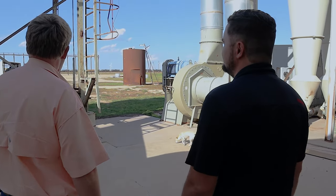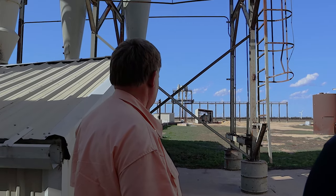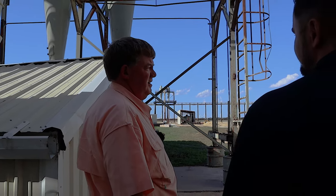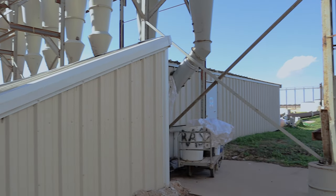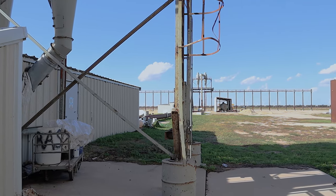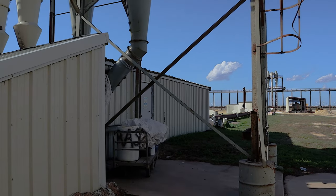What's with the new tank there? Fire suppression. Okay, so hopefully. Hopefully. And that's just for the burrs? Yes. Well, yes and no. It's a 10,000 gallon storage tank. We're going to be tying into it with some sprinklers and this, that, and the other to go up on top of the burr pile. We also pull water out of that tank, come into the gin to feed our RO system. We have an RO system on our humidifier because as you're cooking that water with this hard mineral, it corrodes up pretty rapidly.